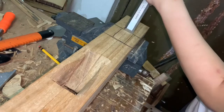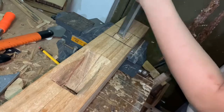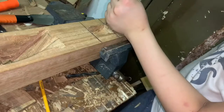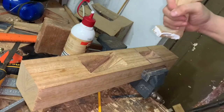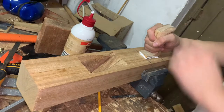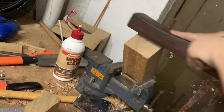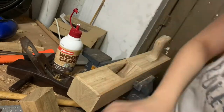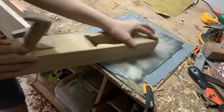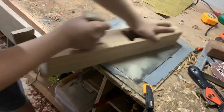After that, I'm going to mortise out a hole to fit my handle in. I've cut it undersized so I'm still going to do some paring. Next, I'm just going to glue my handle into the mortise. Then I'll do some shaping to make the plane more comfortable to hold, and flatten the bottom with some sandpaper on glass, and sand the whole thing so it will look nicer when finished.